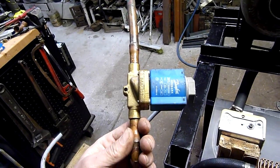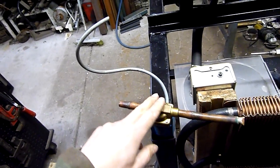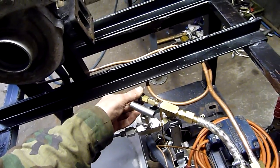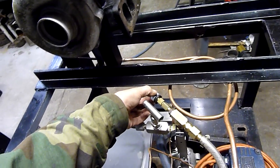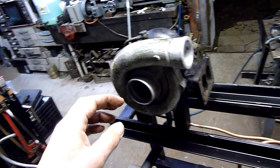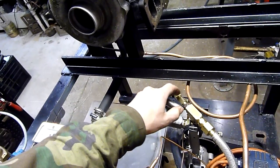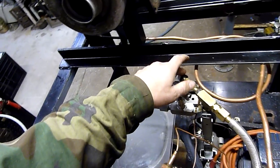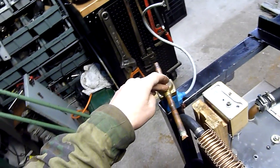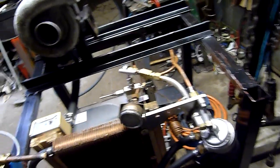I'm going to have a 240 volt solenoid valve — I will have to have mains connected up to this thing, but that's not a big deal. I'll have a 240 volt solenoid valve off this switch here, which opens at 15 psi and closes at 30. So it will close and allow LPG to flow to the turbine when I have 30 psi of oil pressure. If oil pressure drops down to 15 psi — which is pretty damn low — I wish I had a pressure switch which had a better range, but if it does drop down, it will close this solenoid valve and shut off fuel before oil pressure reaches zero, just in case of a malfunction like a line rupture or something stupid like that, just so that I don't starve the turbine.